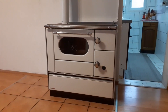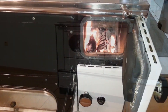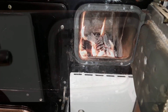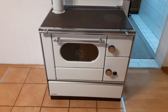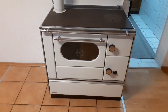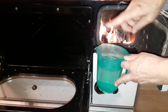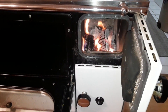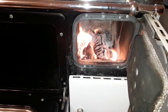When you don't want to use the stove anymore, you'll naturally want to put out the fire. The best and perhaps only proper way to do this is to let the fire burn out on its own — simply stop adding wood and close the air vents. Know that the stove will be hot or warm for the next couple of hours even without any fire in it. These stoves are made this way to emit heat as long as possible and be as fuel efficient as possible. Any kind of violent attempt to put out the fire, like with water for instance, can seriously damage the firebox bricks, bottom grill or even the working surface. So the only proper way to put out the fire in a stove like this is to plan ahead, stop adding wood, close the vents and wait until the fire burns out naturally.